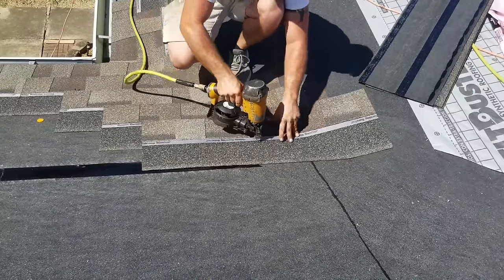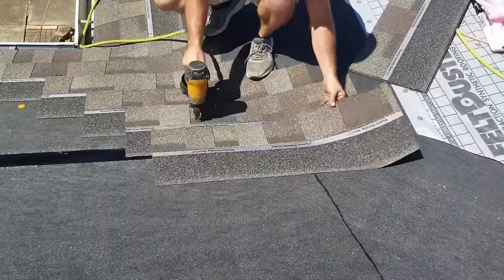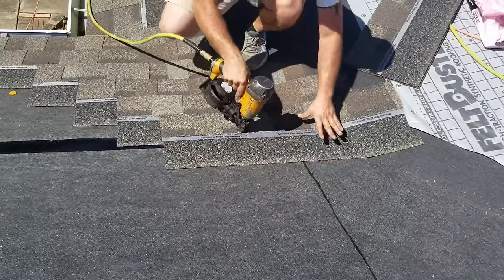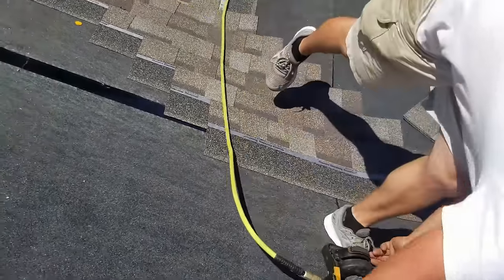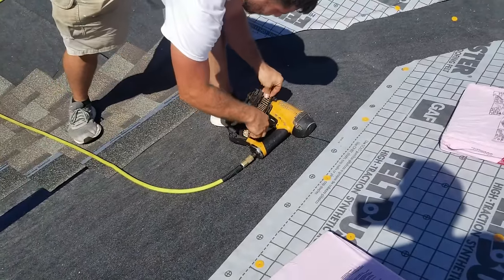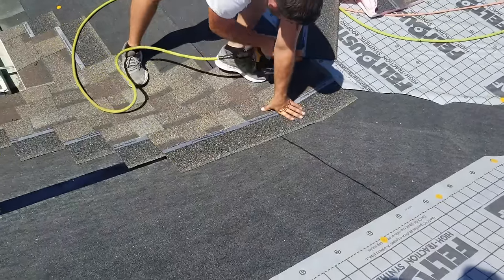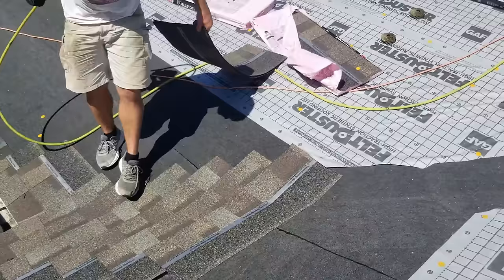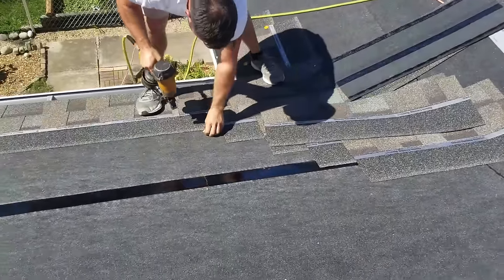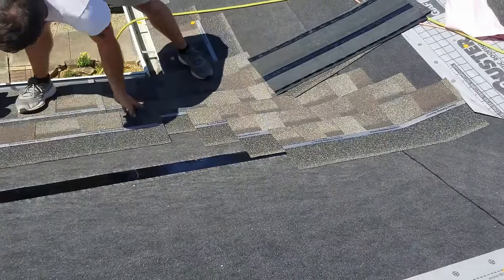So, as a good quality shingler, you should be able to put four shingles up, sometimes more, without losing the straightness, right? Because if you look at a lot of valleys, you see they frown or smile, just like your ends. Well, here's how you correct that, and that's by going from the outside in. And I hear too many people telling me to go from the outside in. I am. On some of my videos, they don't understand that I am.